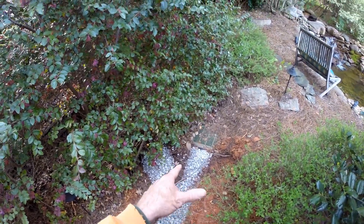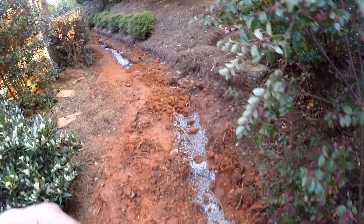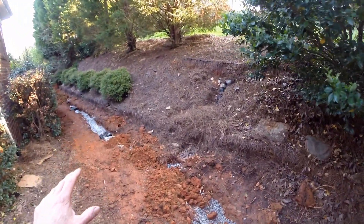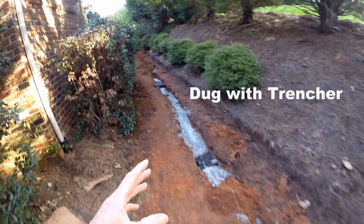You can cover this with soil — you don't need any kind of fabric. That gravel is the fabric, and it keeps out the dirt. Don't be fooled by people telling you otherwise. From that 18 by 18 catch basin going around back, it works great. All the water coming down this hill, both subsurface and surface, drops into the system and is carried away.